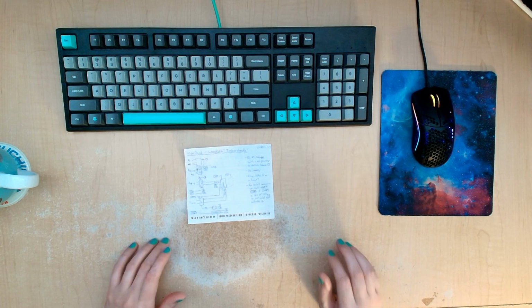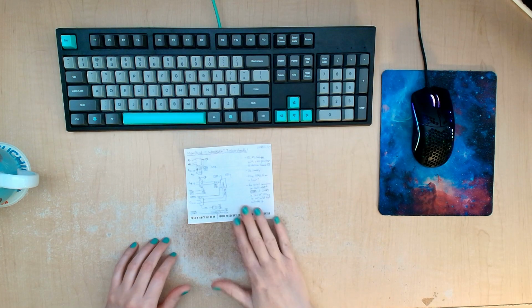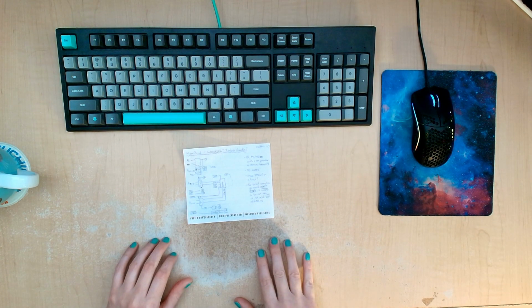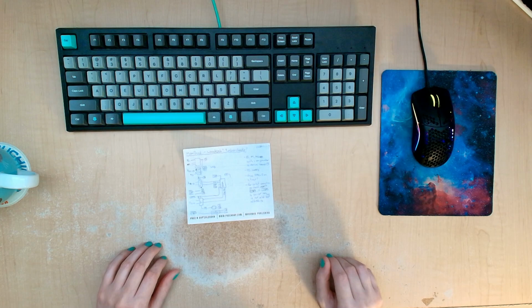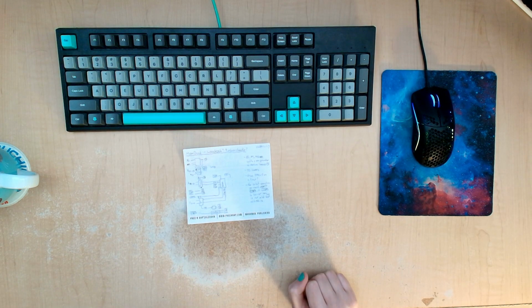One of the things with that is that they are 3.3 volt. So it would be nice if I could make a card that could take either 5 volt or 3.3 volt, parallel interface, standard sort of static RAM chips, and interface them to the VME bus.